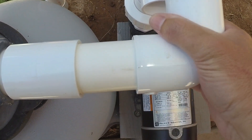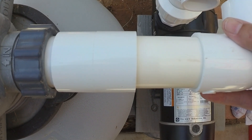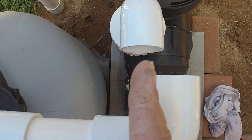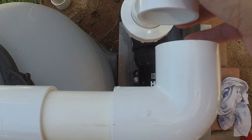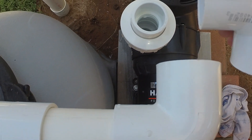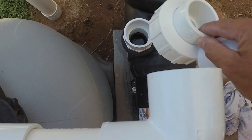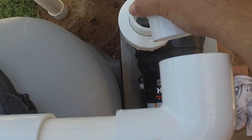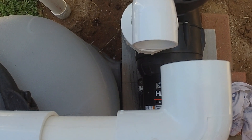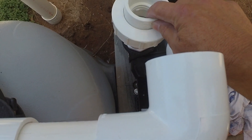The next part I'm going to do is glue this piece into the custom piece we built earlier, but I'm going to have to slide it in just far enough to line up with where our other pipe will eventually be. There'll be a short piece of pipe between these two, a piece of pipe here that goes into this union, and then a piece of pipe on the other side of the union that goes into the fitting connected to the pump. So all of this is going to be about alignment — I've got to cut pieces of pipe to go between each of these, creating a shape where we can remove it at this end and at this end because we've got this union in place at the pump.